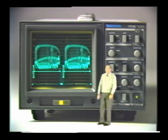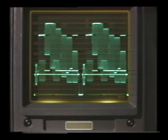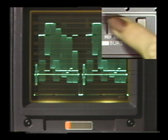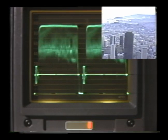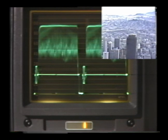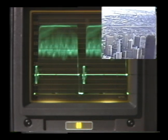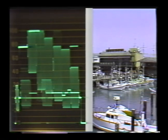Getting back to our other timing measurement — we should check burst phase. Again, we'll use our prime signal on channel A. To match the color burst of the other signal, make sure the prime signal is displayed before you begin the measurement. By turning on the burst phase indicator and pressing reference set, two green lights indicate proper operation is set. When we select the second picture source on the switcher, you may see the color shift and a red light come on. As we adjust the burst phase of our picture source — again, on the camera or time-based corrector — the yellow lights appear followed by the green. Since you've matched both the timing and burst phase of the two sources, you won't see timing or color shifts when switching between sources. Repeat this process for each picture source you use, each time comparing the picture to the prime signal.